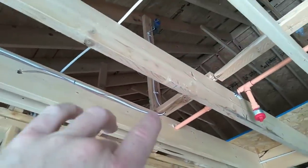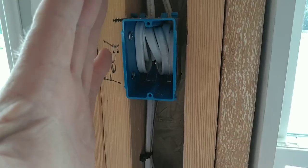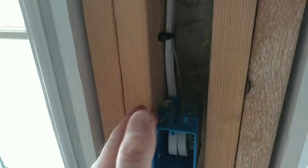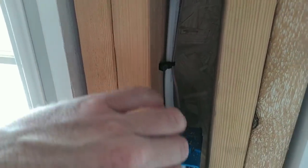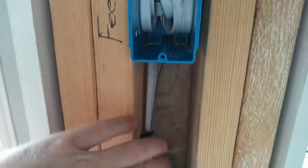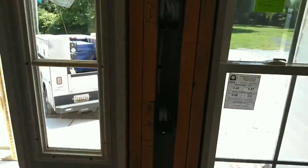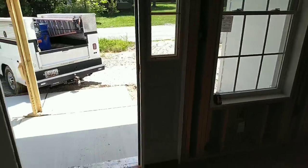Some inspectors frown upon this — I've side-screwed that box on both sides. Not having room for a physical staple, I've used zip ties with eyelets at an angle to get a screw in to secure these wires. I've got three in this location. Something on this house got screwed up — I'm not sure if it was on the print or what, but looking at this door frame, it's supposed to be centered in this wall. This space ended up large, that space ended up small.